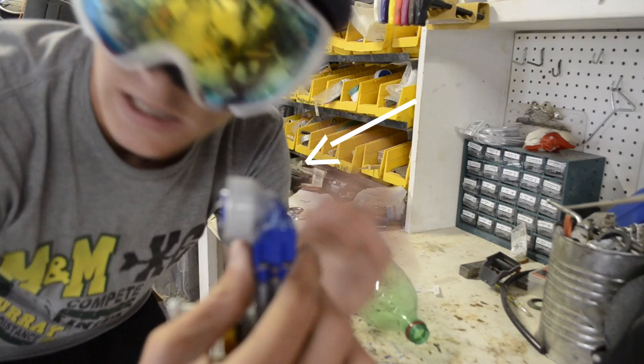But when it did successfully run, it didn't run that well. Namely, its run time was horrible, and this was because of that huge 4cc engine displacement — that's completely unneeded. It doesn't really add any power and it just gets rid of efficiencies. Also, it was extremely leaky, from the air bottle cap where I used an injection molded bottle cap and just hot glued it onto a 3D printed part.